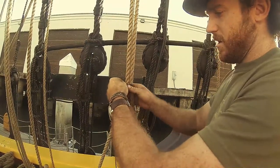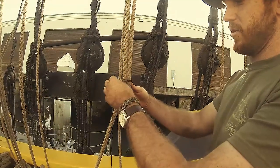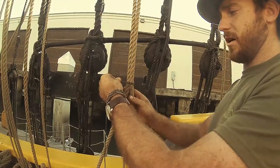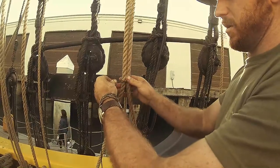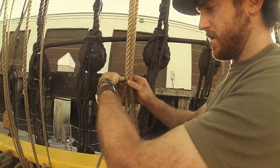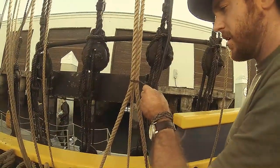You also want to make sure that your two lines are sitting nice and flat next to each other. If you start wrenching on your seizing with your marlinspike, sometimes they'll cock to the side — you've got to work them back into place continually. You want the eye of the eye splice right in between the two legs of the seizing, and then you're going to lay each turn upwards from the first one.